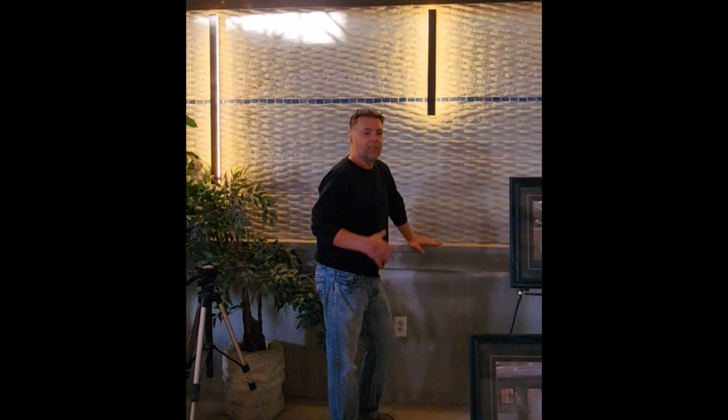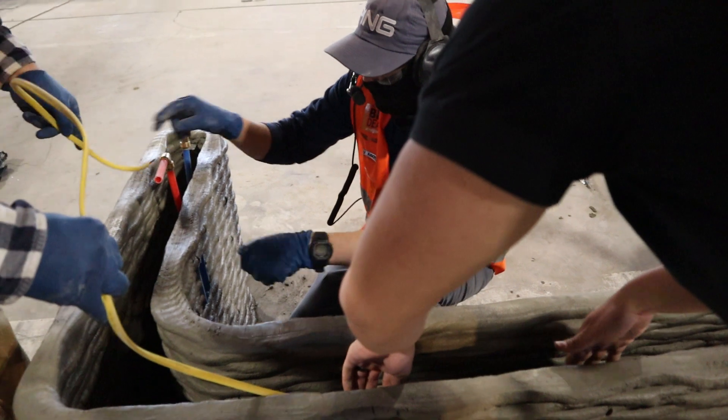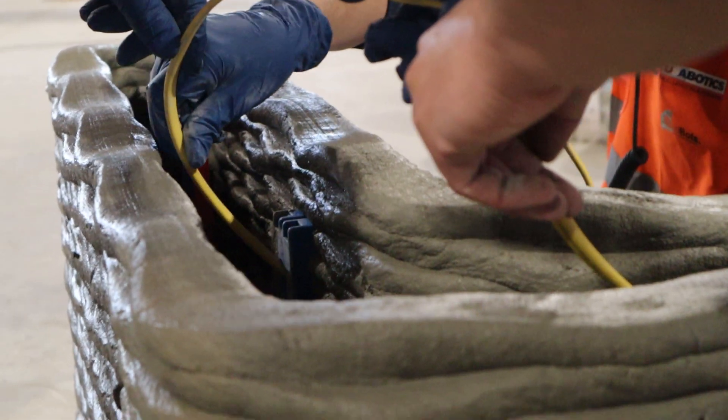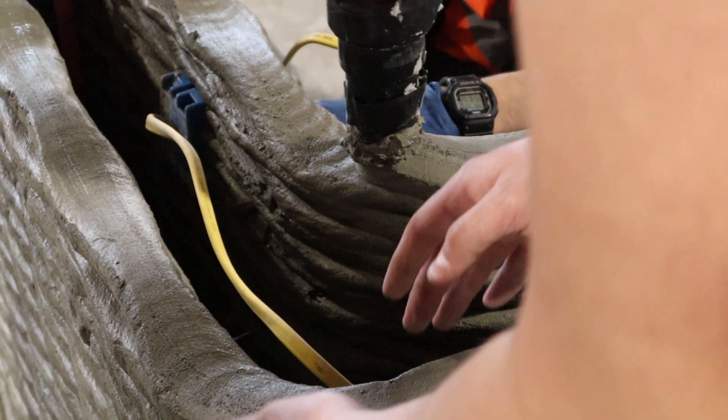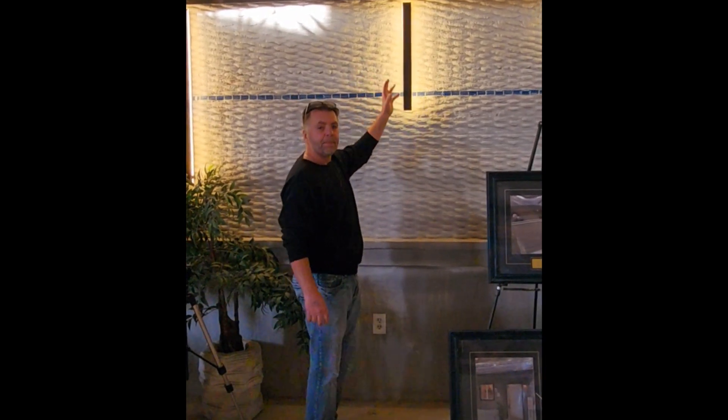We want it printed in a day, two days tops. Some people are choosing to stop at wainscote height so they can play with their electrical and plumbing. These are usually paper contractors that don't do the electrical themselves, so they want to stop and let everybody in. We don't teach that process — we teach how to lay the electrical in the wall while you're printing, do your plumbing while you're printing. Nevertheless, people get home, they get nervous — these are generally people with less experience in construction. You stop at wainscote height — that would be one day. You come back the next day after the electrical and plumbing is done and finish out the print.